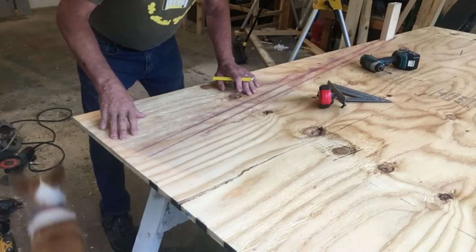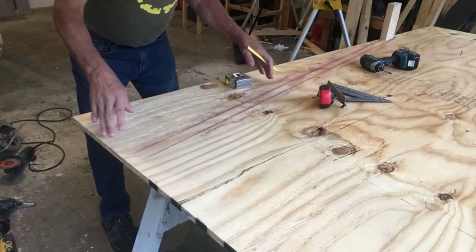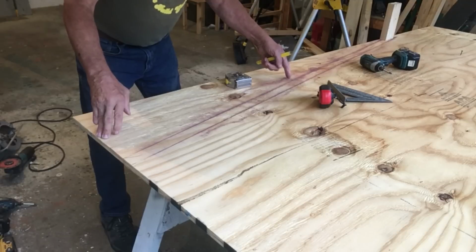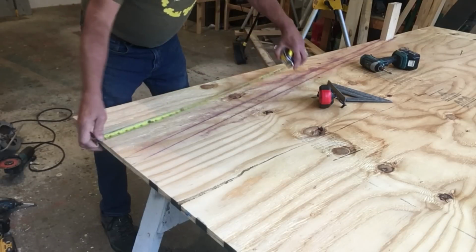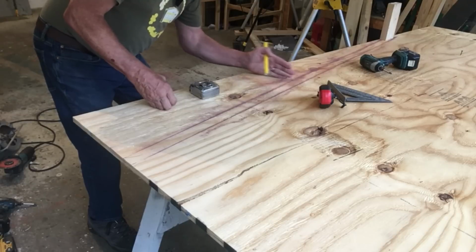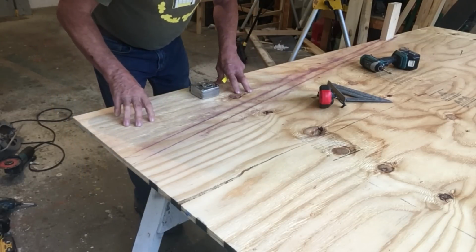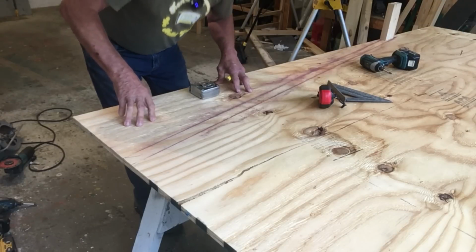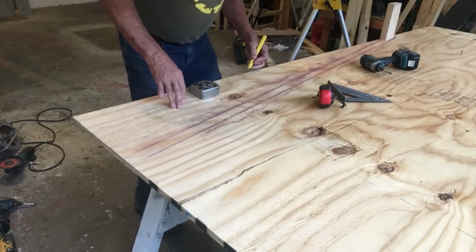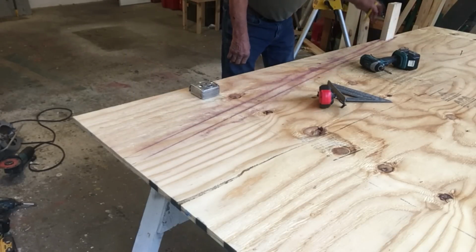All right, this part is actually structural. I'm making the box outline for the outside of the Vardo. And so I came up here, I think it was 30 inches, 32 inches. And I'm making it so that it's a 6/12 pitch for the roof. So I'm going to leave this on because this is going to add to the stability of the Vardo on the trailer. So I'm going to cut here and cut down through there to this subfascia.